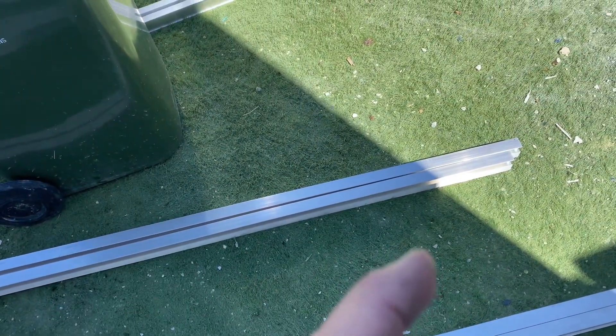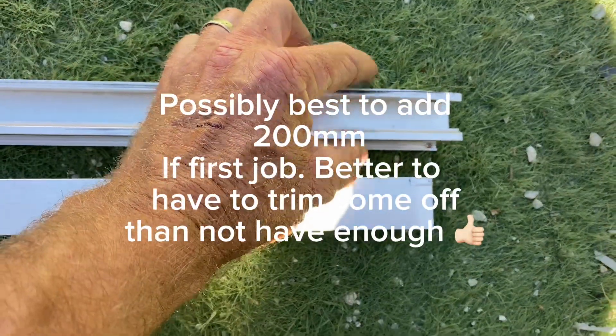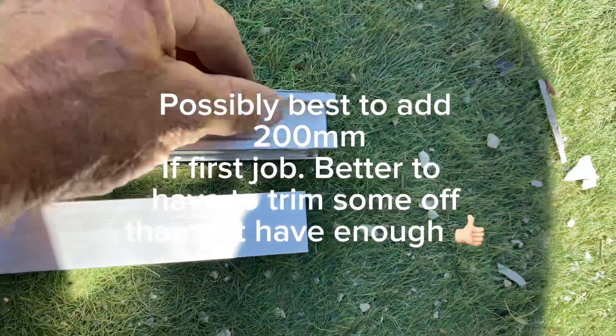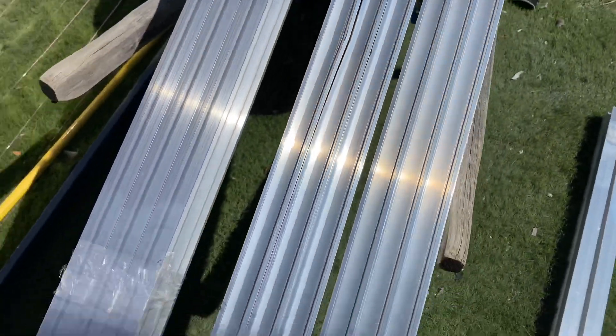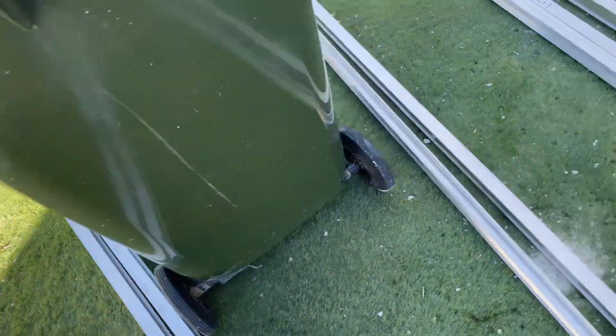At the end of the panel you should have your clamp and then another 30 millimeters left over after the clamp, because if you don't leave enough space, when you tighten the clamp it will actually spread the rail and the clamp can pop out. I've just noticed a lot of this rail is damaged — some more damage there — which is disappointing. That could make it hard getting my clamps in on the roof. This is Clenergy rail. You should always read your manual relevant to your rail type for installation instructions.